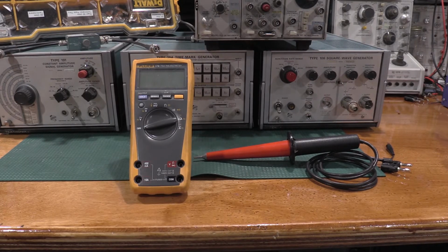As with all troubleshooting procedures, you will need a DMM. Everything starts with the power supply. If the power supply is not good, don't even try to calibrate the scope. It's not going to work. Something's wrong. You have to get the power rails to be in spec before anything else. That's why the very first step in all the manuals is deal with the power supply. If the power supply is not in spec, it's not going to work.